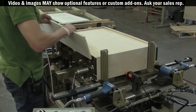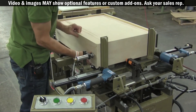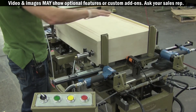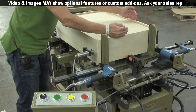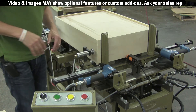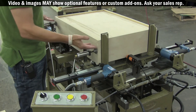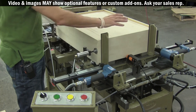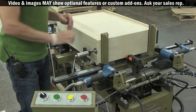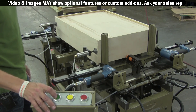Then the drawer back is put in between the drawer sides. Everything's all assembled but loose, and the other pieces are held loosely. I'm in hand mode, so now I can instigate the next step. What we've done there is clamped the outside toward the front and clamped the side to lock all the pieces in position. To instigate the stapling in hand mode, I can either use the staple button or the next button — either one does the same thing.